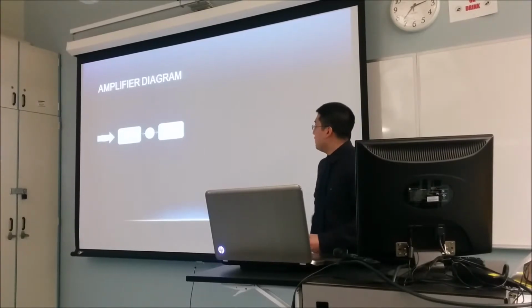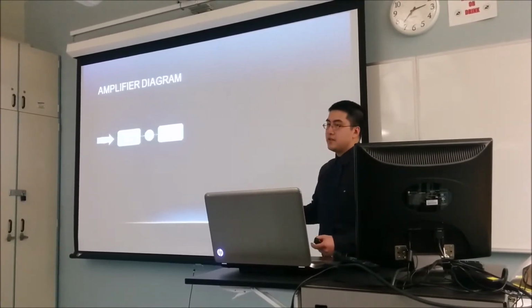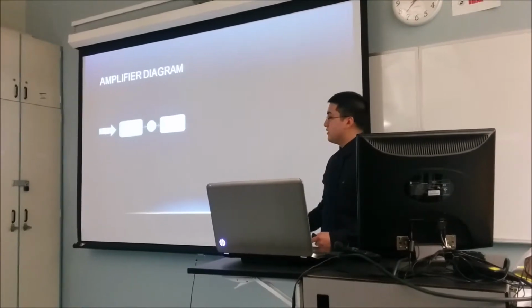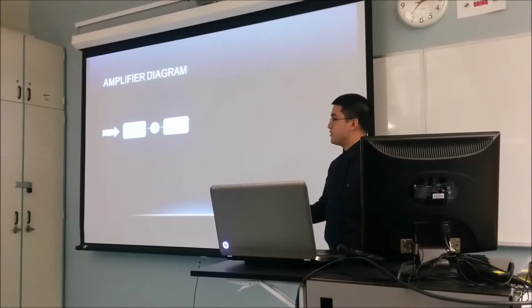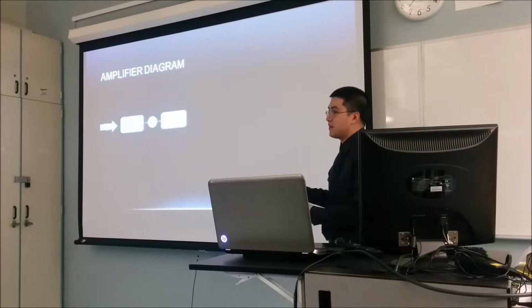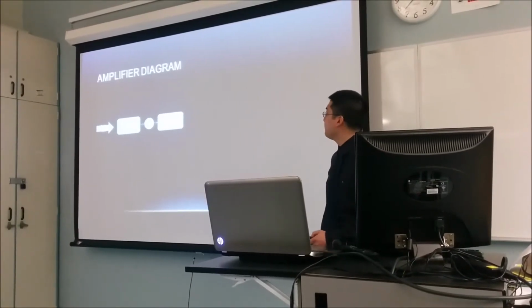What essentially happens is that circle there represents, you can think of it as a knob on the amplifier. So the first knob is the gain. Essentially you're controlling how much drive the next stage gets. The further up you turn, the higher the amplitude received in the second preamp, and the more you're overdriving it and thus distorting it.